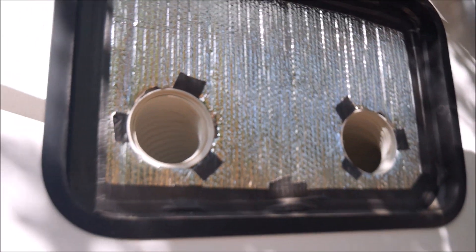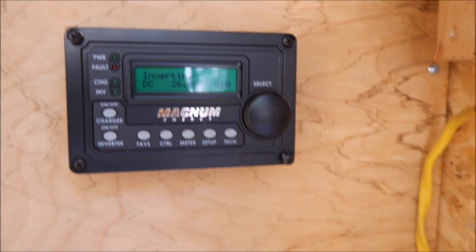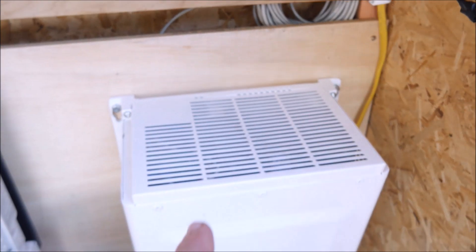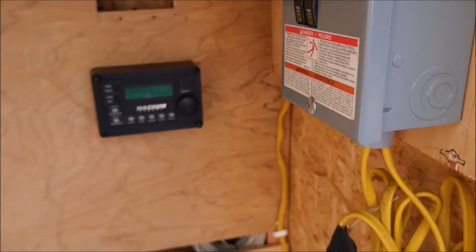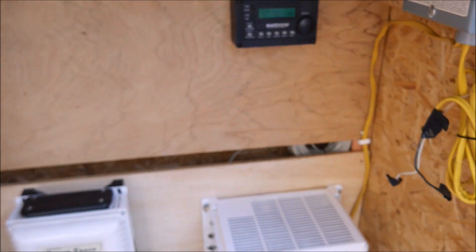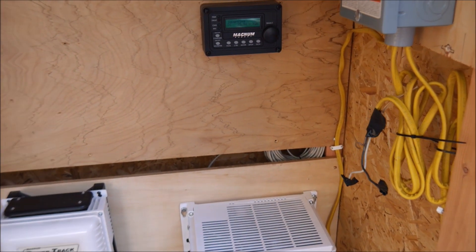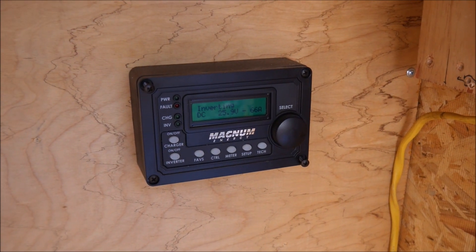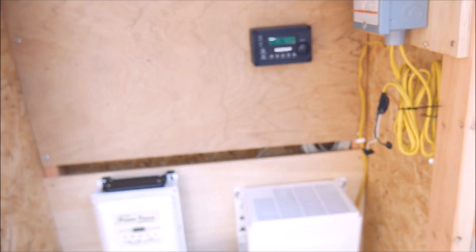It's on and running. As you can see, we're drawing 60 amps — that is the power the inverter is drawing from the battery at 24 volts DC, which it's inverting and outputting as AC. It's not 60 amps of AC power. It kind of ranges between 1,000 and 1,400 watts, so that's well within spec. Everything looks good — there's no alarms or beeping or anything weird. The voltage is hanging steady, dropping a little bit but hanging in the high 25s. So that's good so far. I'll come back in a couple hours and we'll see what's going on.